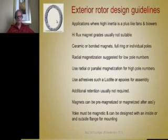neomagnets. Usually the magnets are magnetized radially, but they don't have to be. In a real large machine, they could be parallel magnetized. It wouldn't make much difference. You can use adhesive or epoxies to hold them to the yoke. This yoke could be laminated. It could have flats in it to locate the magnets any way. It could have dovetails in it.